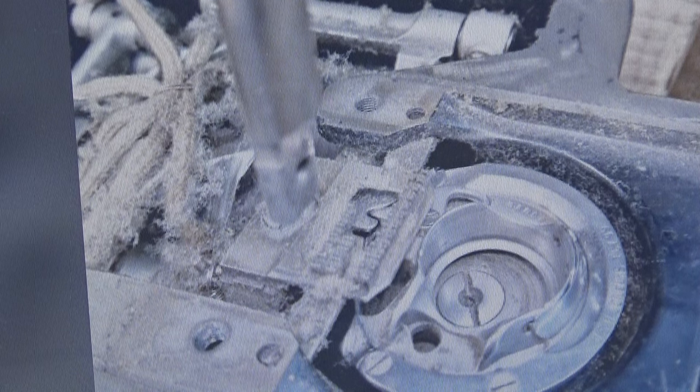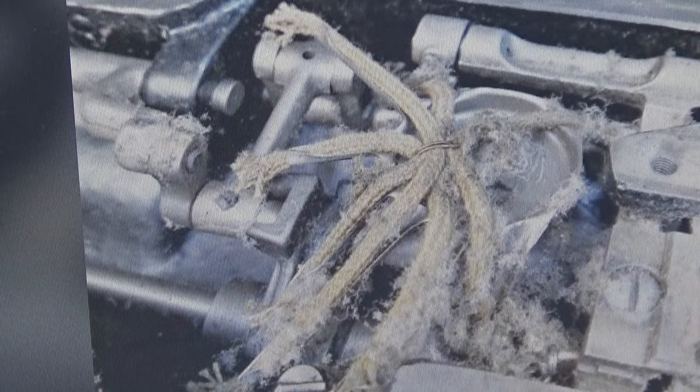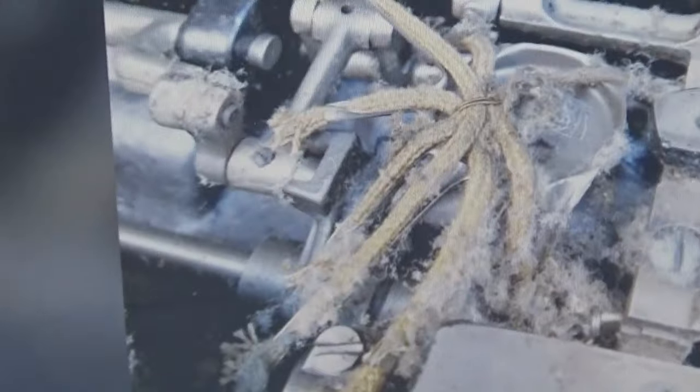And it's going to drop down into a little cup, which I think will be visible in one of these shots. And it's just to the left there. And then that oil basically gets sucked up by these little octopus arms. We'll just call it the wicking arms. And you can see how they jut out to all the main pivot points. So that oil works its way from the little cup that you can't really see well there. Well, you sort of can, right there. See it right there? That's what, whoa! Crash and burn, buddy, crash and burn.